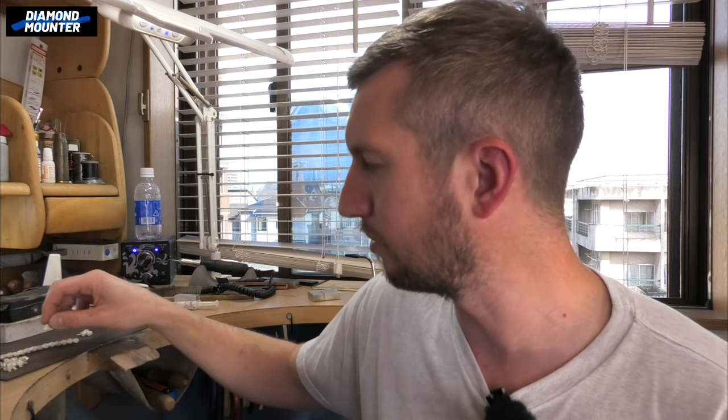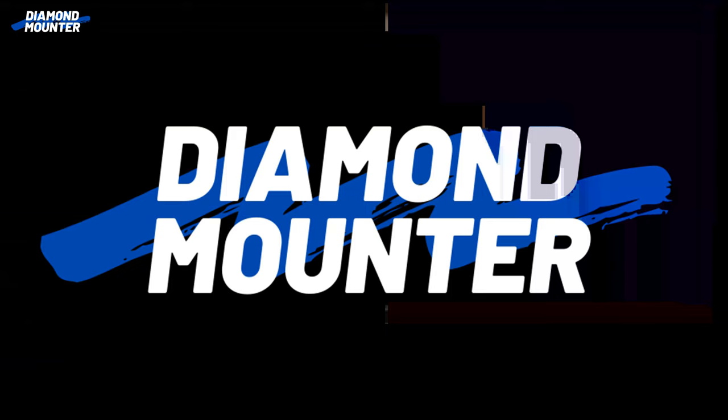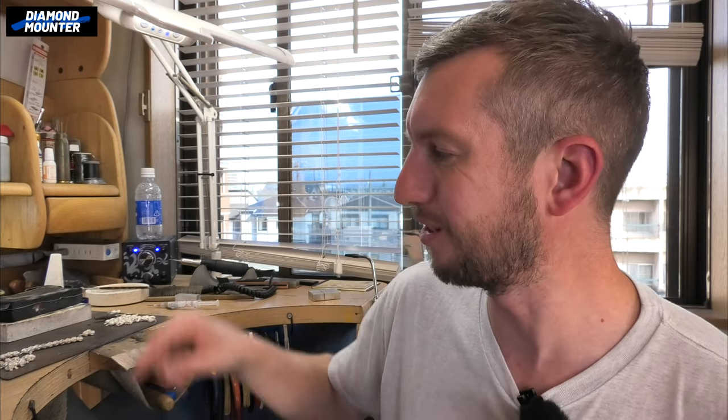It's definitely faster than working completely on one piece and then moving to the next — the time it takes just picking up tools and putting them down all adds up, so a production line is a much faster way to achieve the same thing. Just sharing a bit of my experience from doing multiple castings in the past. I recommend breaking it up one way or another, not doing too much of one thing over and over again — it stops you going mad and saves wear and tear on your fingertips. With buff sticks especially, if you're holding something quite small and buffing a lot, it doesn't take long before your skin wears away and you end up with a very sore patch on your fingertip. Learn from my experience and my suffering — I had a cut on my finger last week, and it's quite troublesome doing this job with cut fingertips.